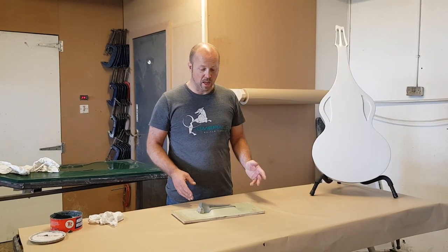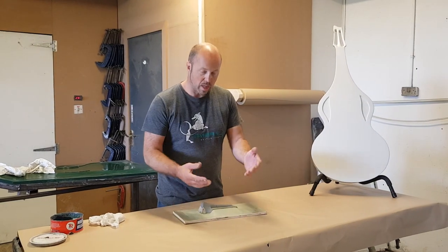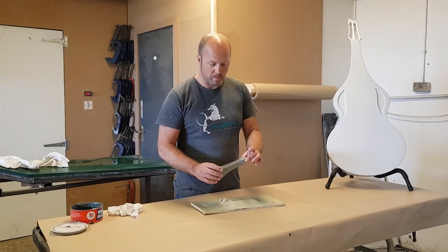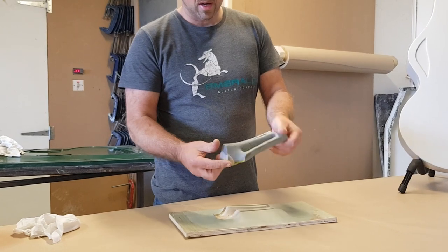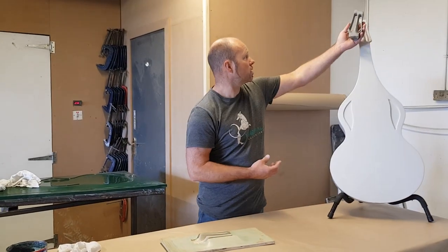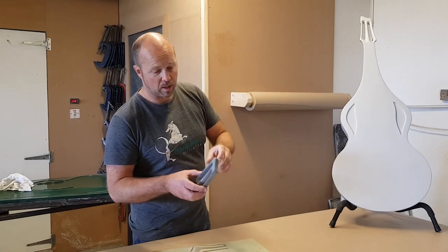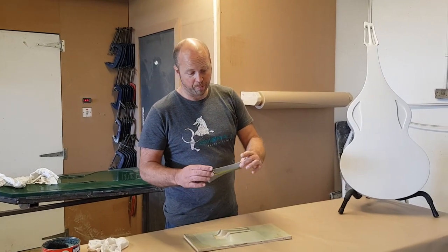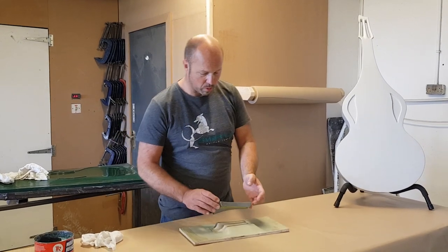What I'm doing today is molding the headstock. Inside the headstock there's going to be a solid section — we cast that last week and that is going to be the shape of what was inside the headstock. It's basically a miniature version of what's up here, two millimeters smaller than the outside profile, and it will be covered with a skin of carbon fiber in the process.